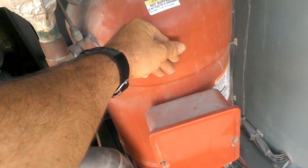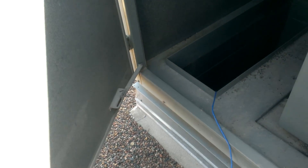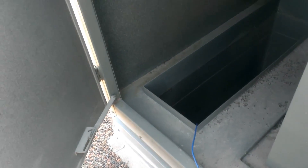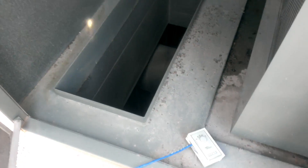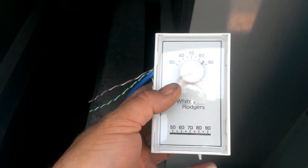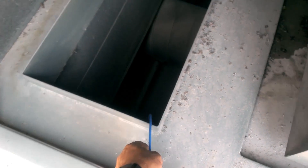Right now the pressure's not on yet. I'm going to go kick it on — I just need this thing to run. It seems the HT800 controller thermostat base is bad. So I'm just going to wire around it to bring it into cooling mode, because it's really hot down there. I'll set the compressor to kick in at about 80, maybe 81 or so. I'm going to run it to cool in there.